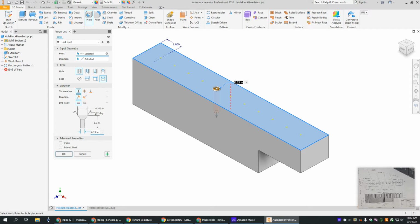And then we have to tell all the different parts about it. Up here at the top, this is the countersink, and this is the diameter of the countersink. If we look up here, remember it was 0.88 inches. So we're going to change this to 0.88 inches. And then it said it was at 60 degrees. So we're going to change this instead of 82. We're going to make ours 60 degrees.